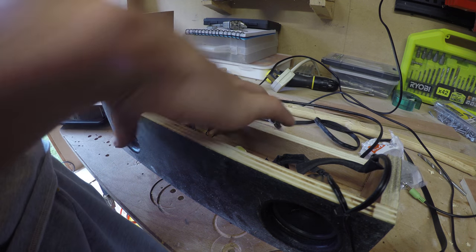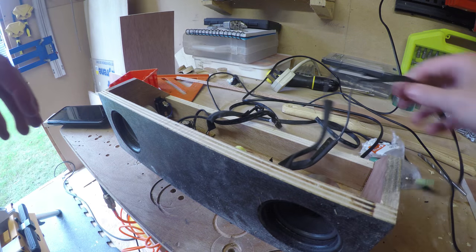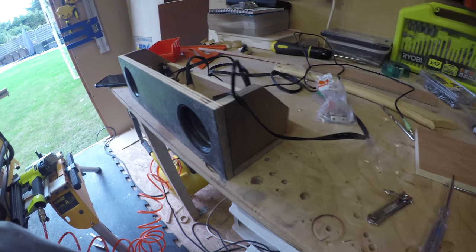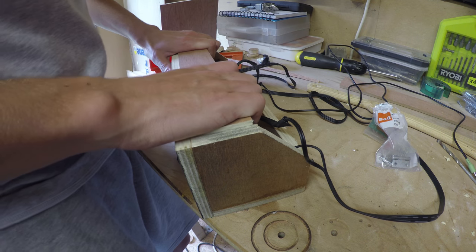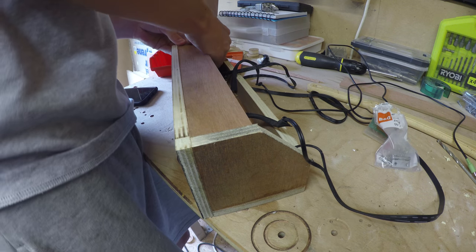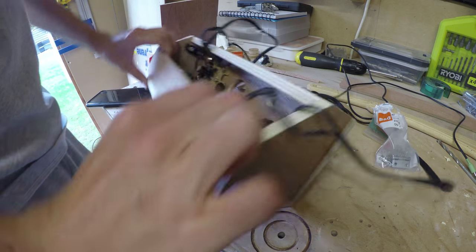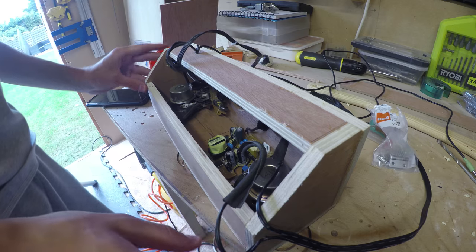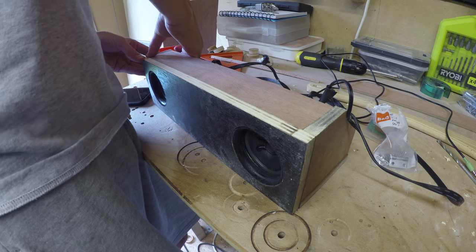So now I can hinge. Now that I've got everything in, I can set the things in place, so now the top in, and then we can get on to painting. So I've got my main top piece that I can just now slot in, get it in position. Now I'm not going to glue this piece because I won't be able to clean up the squeeze out, so I'm just going to nail it in place, and that should be more than enough to hold it in.